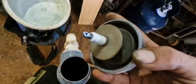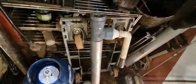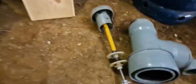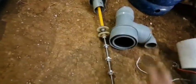I show you here that I did it with this once. And this worked already pretty good, but due to the high humidity or the small water droplets accumulating all over the place, the electricity went somewhere else and shorted itself out after a few hours. So with this one, I estimate it doesn't do that so severely because it's better isolated. And it has a liquid secondary electrode to wash away all the droplets. It doesn't accumulate anymore all over the place.